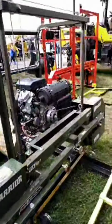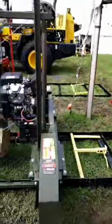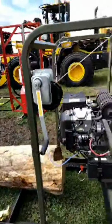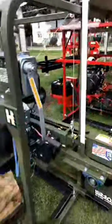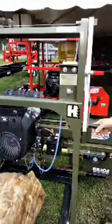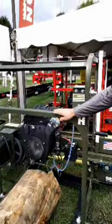Now this is the Warrior. What's the difference between the Warrior and the Oscar? Okay, it's basically the same as the HFE line. The Warrior is built with a bent tube frame. The posts go up on the front, so the posts are actually part of the frame. I see a new gusset on here. Right, we found a little play in some of the mills, so we made a new gusset for the front of these. It's all one solid piece welded in over the tube that's across.